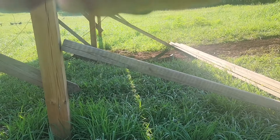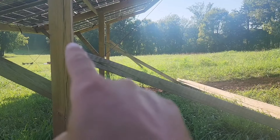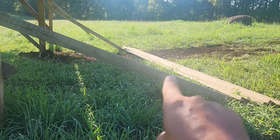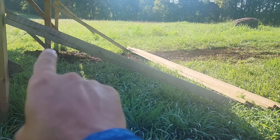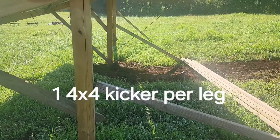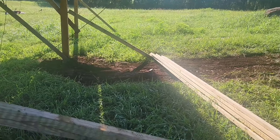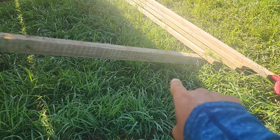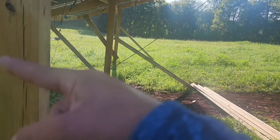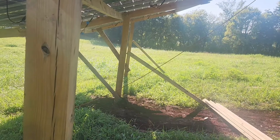What I'm going to do — you can see these four-by-four posts just laying here — I'm going to run some kickers from about here down with some more six-by-six posts, maybe cut them off about a foot up, and put the four-by-four posts kicked into that to brace up the legs, three on each one. I'll also concrete those posts in like I did the others — about two feet down — and then put X-bracing on each one.